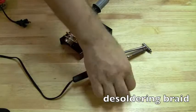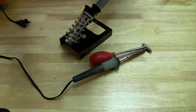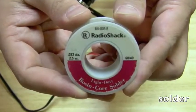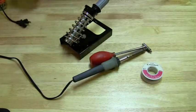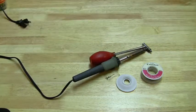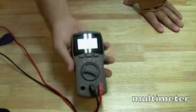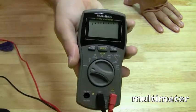It's neat — you actually squeeze that little red thing and when you release it you can suck the solder out through the soldering iron. Or you could use desoldering braid, which is another thing I use in conjunction with the desoldering iron and it works great. This is the solder I use: 60/40, 0.032 inch diameter, rosin core solder. I get that at Radio Shack, and that's pretty much my soldering kit.